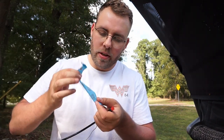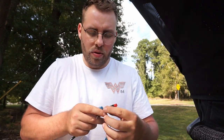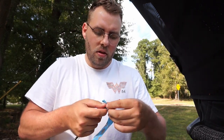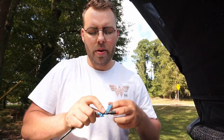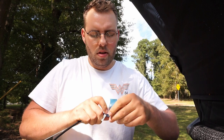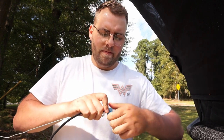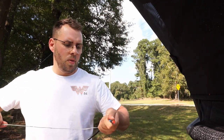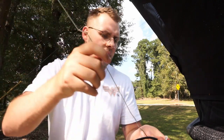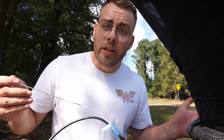And then you're going to tape the cable to whatever it is that you're using, your stiff wire, your coat hanger, whatever it may be. Just tape it up nice and good. And then now you have something a little bit more controllable. Bend it just a little bit. And then you're going to run it through the hole that you made up to where you're trying to get it to go. So there's a good tip for you.